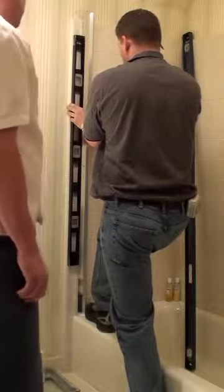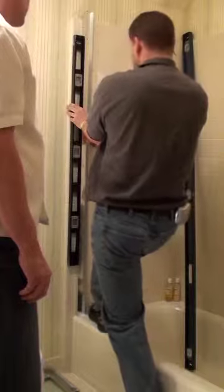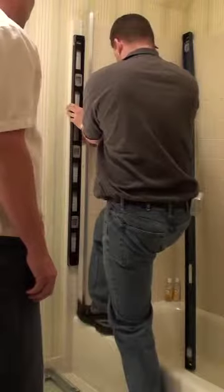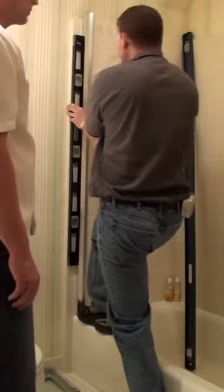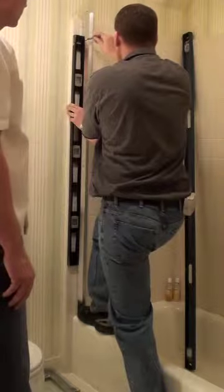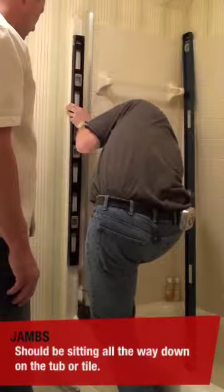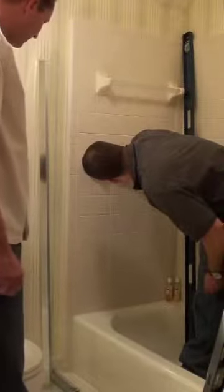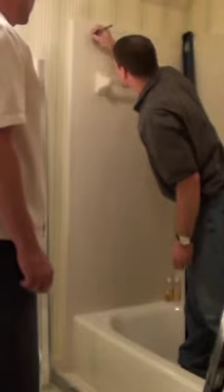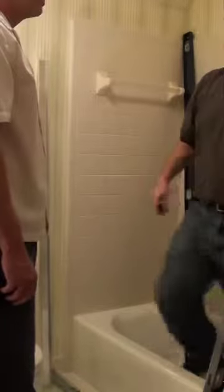A lot more crucial, especially on measuring the slider, you really want to be cautious to make sure that the tubs are fairly level. The rollers have gotten so good that the doors roll so easy that if you've got a severe edge on your curb, your door can actually roll a little bit on you. So you've got it level, jam sitting on the threshold, jam sitting all the way down — mark the holes. I'll just make sure that my marks are really easy to see so I don't lose them if I step out to pick something up.